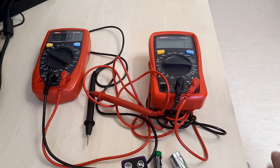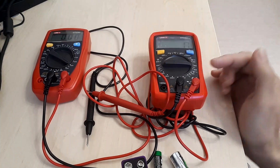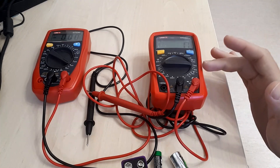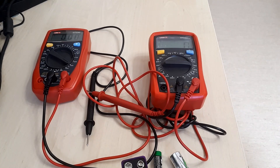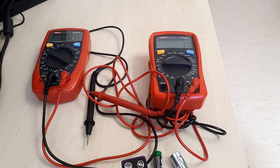Now you can see one of the more meaningful differences. The older multimeter had a maximum voltage range of 500 volts. The newer one has 600 volts. This pertains to the internal design of the device — I'm pretty sure it was slightly improved and probably better able to carry higher voltages, though it may also be a marketing decision, since most products available on the market already have a 600-volt measurement capability.